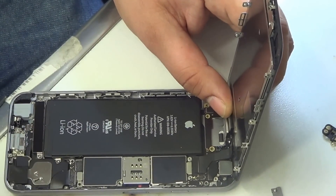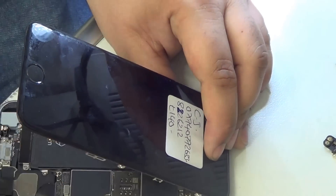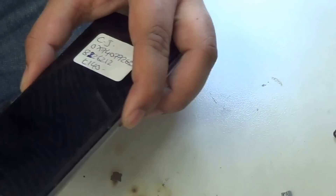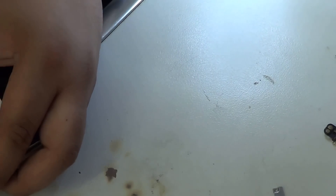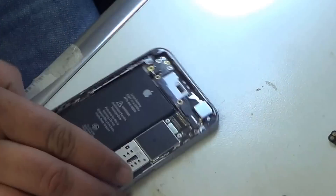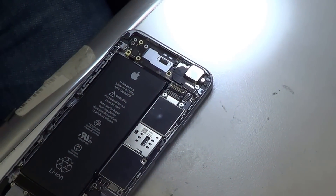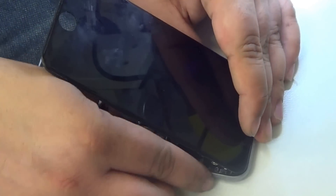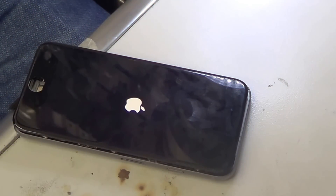This is the test screen I'm going to put on — remember I soldered the pin from the top, so I didn't want to mess up the ribbon cable. I've connected iTunes to check whether it's coming on — and it was coming on. Next I'm going to visually see if the connector has pressed the solder down. It had, so I tried the new screen, and voila — you've got the display!